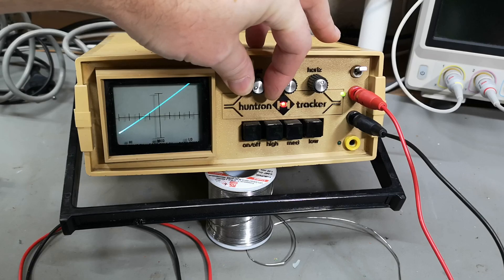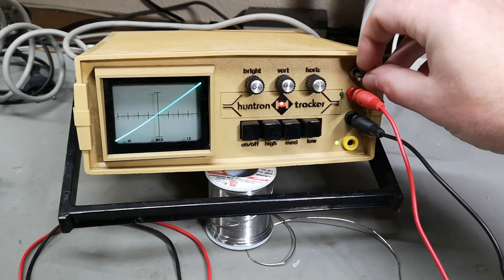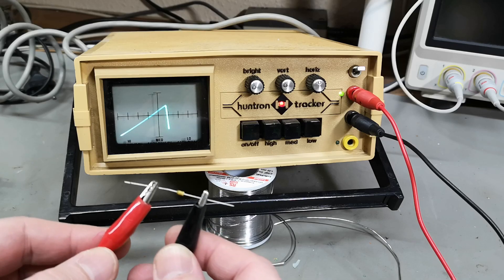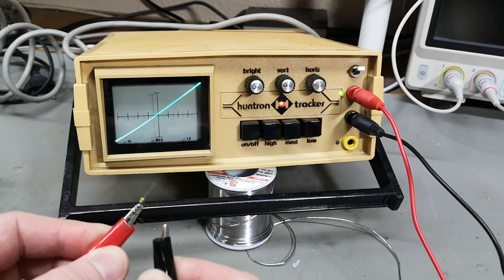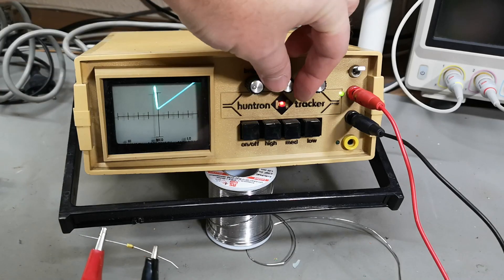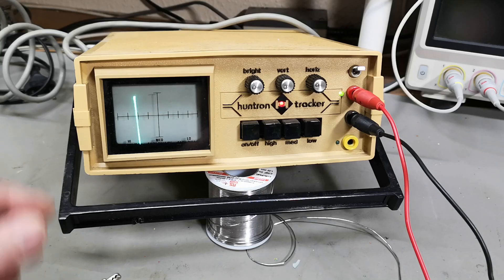So there's a line. This is how we select... all right, so now there's no signal. This is a 12 volt zener diode. Look at that - let's try and reverse it. If I short it I get no voltage but a lot of current, and then the other way - now what do you know. So if that is what I think it is, we don't see the breakdown. This has got to be the low voltage part of it.